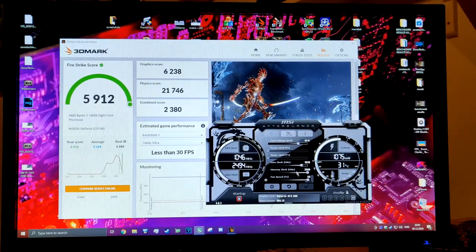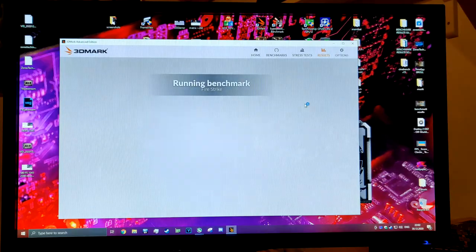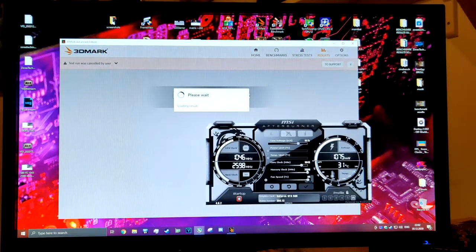2600? I think this is gonna really crash, because 2600 on the other card required literal ice cooling. But who knows, maybe this one's better. Maybe the memory chips are actually running cooler, not having a heatsink on them, compared to having the reference heatsink on it. Because it literally just sinks the heat into the base plate, which has basically no surface area. It has no cooling fins and no airflow. It did crash. Okay, 2550 then.